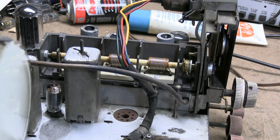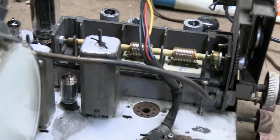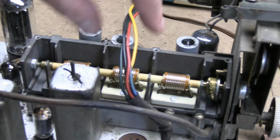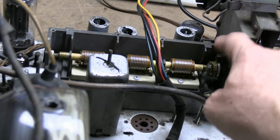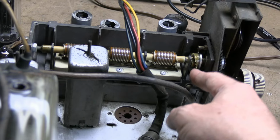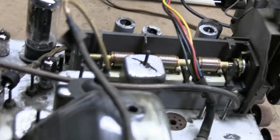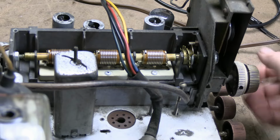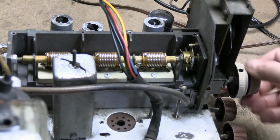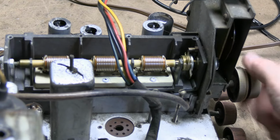At first I thought, well, I can loosen up maybe one end of the shaft and pop it up and slide them over, but this is a complicated mechanism. It's in there pretty securely. I thought maybe I could loosen this nut and free up this end of the shaft, lift it up, slide the contacts over. No, it doesn't work. So what does make it stop? It's this mechanism here. There's a piece of metal that smacks into that, and that's when you're done. And these other little pieces here, it's like there's one little piece of metal for each turn on that coil. And as you rotate these, they move along, move around. I've never quite seen a mechanism like this on anything else, but when you go this way, they're kind of spread all over, but eventually they catch up to each other and they start bumping into each other until they all smack together, and then you're done. And then something similar when you go the other way.